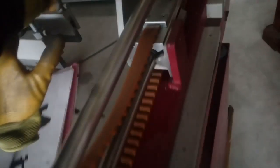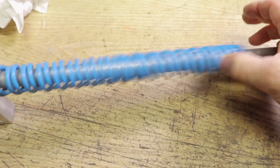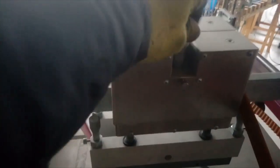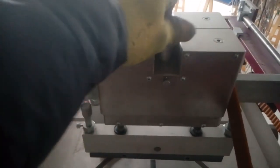This machine has a couple of rod-shaped rails with ball-bearing sleds. On top of them, the central carriage holds the squeegee so it can be moved back and forward. The action to move the squeegee up and down is controlled through pneumatic actuators, and the air is carried through a spiraled tube along the rails. A combination of air pressure and fine height adjustment made by a couple of micrometers assures the solder paste is spread evenly and with consistent thickness across the stencil, which is important for quality electronic board assemblies.